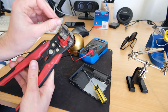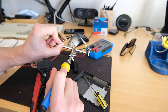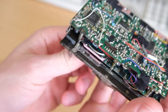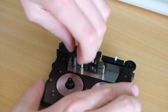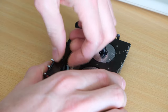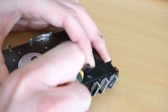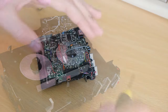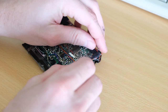The positive terminal was also corroded, so I started pre-tinning a wire but realized the gauge was a bit too thick to bridge from the battery compartment over to the Walkman — we'll come back to that one. I'm just inspecting the hubs, the little gears in the bottom, to make sure there's no bits stuck in there because they will grind away as the unit's running. I have to disassemble the whole thing to get the belt out — the belt's turned to goo, it's a horrible mess. Don't lose that little plastic bushing — trust me.